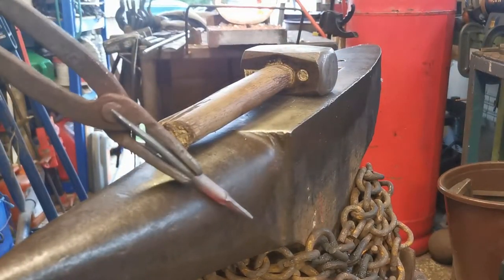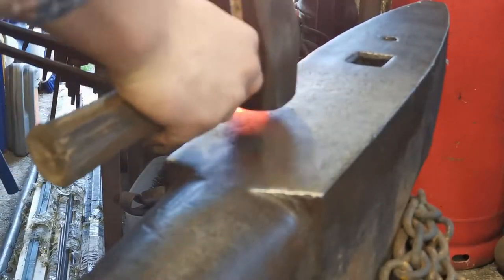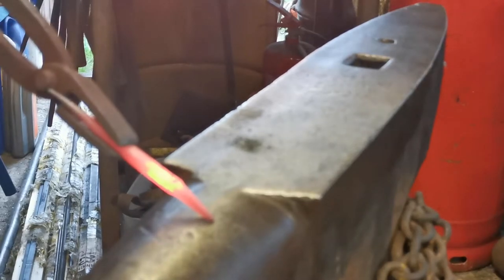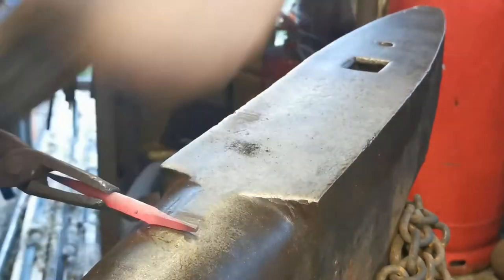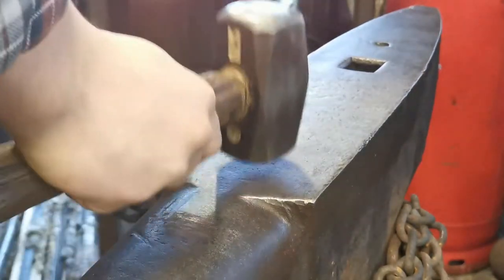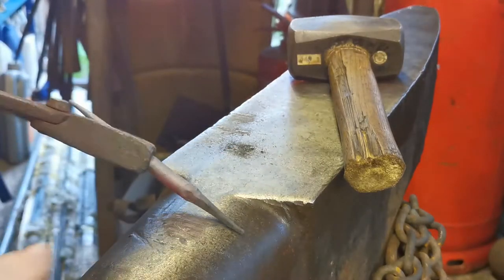There we go - we're starting to get that nice isolation through there. I'll get the camera up a little bit higher in the next shot so you can see exactly what I'm doing. What we're doing is isolating it down. We can use the thicker side of the horn of the anvil - this will just help draw it out a little bit quicker and a little bit neater as well. If we need to, we can take some more material from here and use that to draw it out. We'll continue drawing this out and make it a little bit thinner.